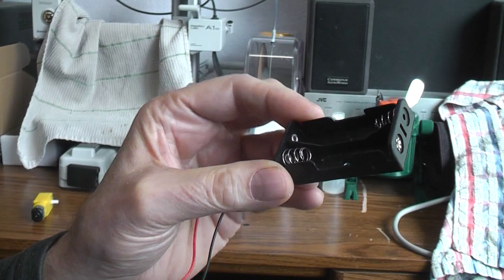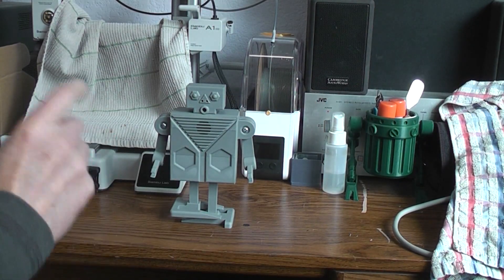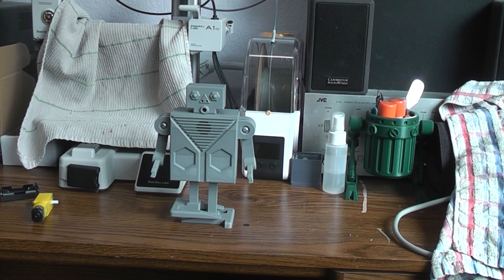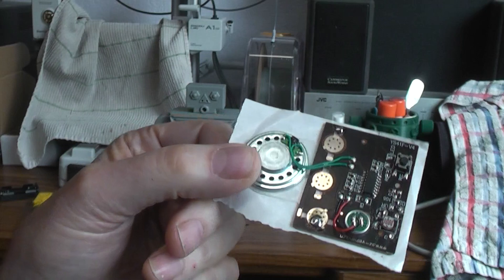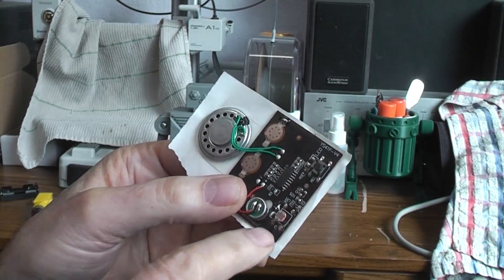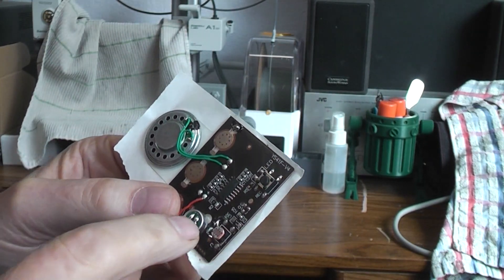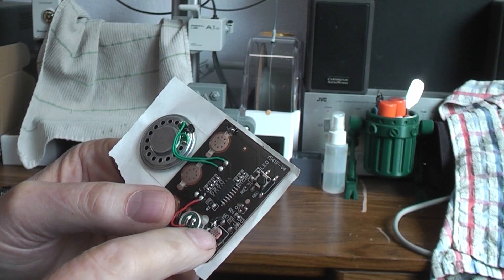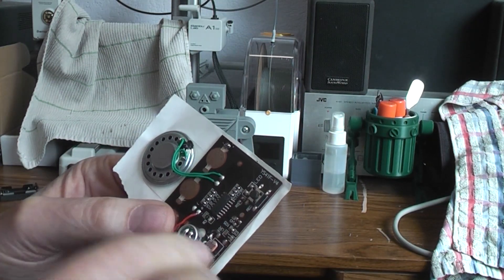It's just using a double-A battery box holder in the back. The switch is my standard slide switch with 19mm mount screw holes. The sound effect could be anything. I'm using this sound card they sell for greeting cards — you can get them really inexpensively online. This particular one has a photo sensor, a light sensor, and it's super sensitive. Even a candle in a dark room would trigger this.